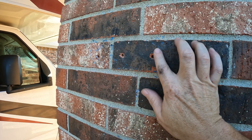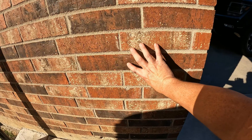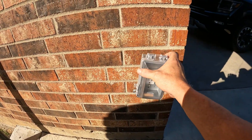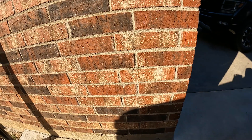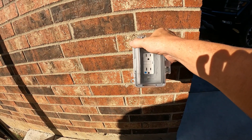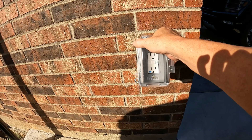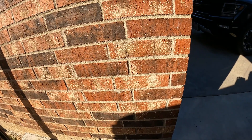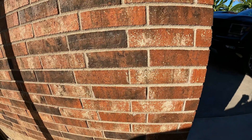If I ever wanted to remove this, I'd go to the main panel, put a plug where we tapped in, and remove these four tap cons — it just leaves a nice pretty solid hole you can fill in and paint. I ended up being pretty happy that my wife talked me out of putting the outlet right here. I was going to put the 30 amp here and the 20 amp here. The only reason was I was getting too far ahead of myself thinking about the 20 amp second AC mod for the bedroom — but if I want to try that, I can just plug it into the garage. Let's go over how much this cost.